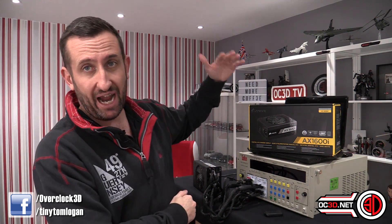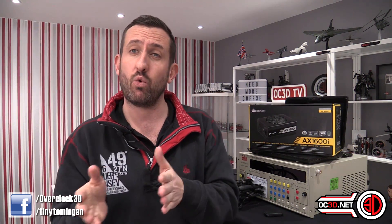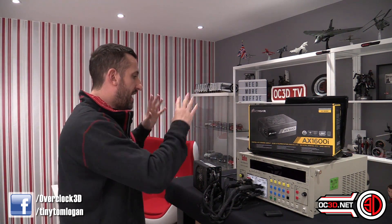I have a Sun Moon power supply tester, and without an extra add-on unit which costs thousands, it can only safely go up to about 1200 watts. I have reviewed 1500 watt and 1600 watt power supplies in the past and I always go up to that 1200 watt limit, which is what I'm doing today. The 20% and 50% loads are always calculated off the rated unit anyway - so 50% will be 800 watts and 20% will be 320 watts - so we've got plenty to work with. I've also got an oscilloscope so we can see the ripple as well.